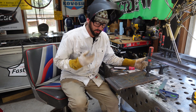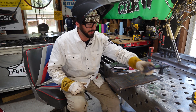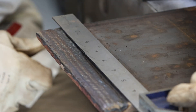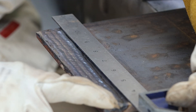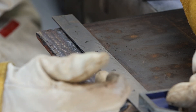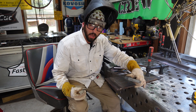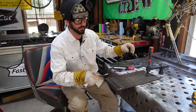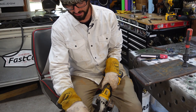We're comfortable and our lenses are clean, but I'm still getting a slightly crooked line. When you put a square on it, the evidence is there — my overlap towards the back of the weld is a little wider than at the beginning. This could mean I have a tighter overlap at the start, or I'm going slower toward the back. To correct this, we can use a couple of tools — starting with the old soapstone, sharpened up.